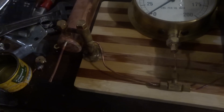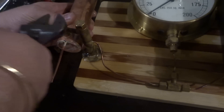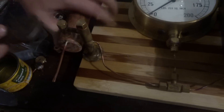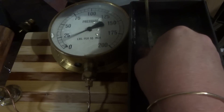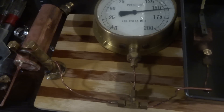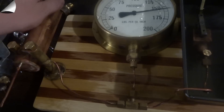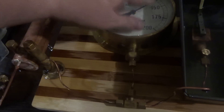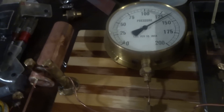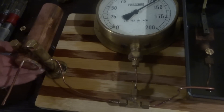Got the boiler on there like it's supposed to go. Do the fitting up — we can't find the half inch spanner anywhere. We should be able to pump that to pressure, and there we are — it's holding 150, about 160 psi. About 15 minutes later it's still sitting comfortably on about 130 on the needle. I can't find any leaks on the boiler anywhere — I reckon we're going to say that's probably passed.